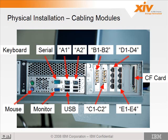Okay. So they're linked together, and you can actually communicate by logging into module 1, connecting to this port. Actually, they use a telnet protocol. They hijack port 2020, and so if you telnet to port 2020 on module 1, it'll actually take you out of this port and into the serial port on module 3. So that's how that works.